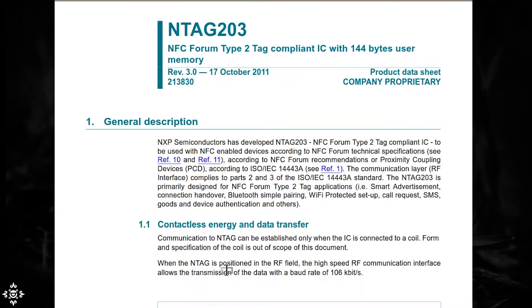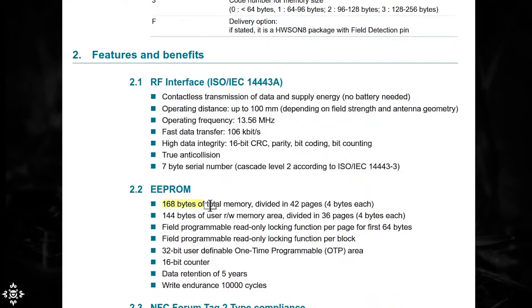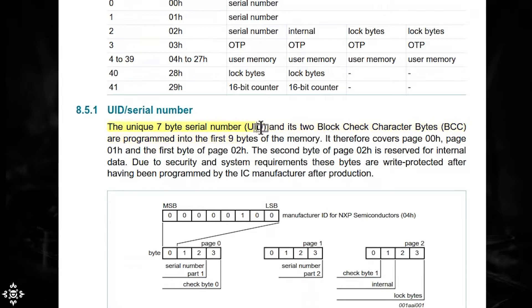But what about security? The manufacturer that makes these NFC chips is NXP Semiconductors. The tag that we use here contains the NTAG203 chip, which is part of the MIFARE Ultralight family of chips developed by this company. Even though you are able to store information in the tag memory, the only thing we will need from the tag in this project is the UID number — that is the unique identifier. This is a 7-byte number that is exclusive to each tag and is assigned after manufacture. We can't modify this number or clone the tags, hence why we are going to use this number as our key.